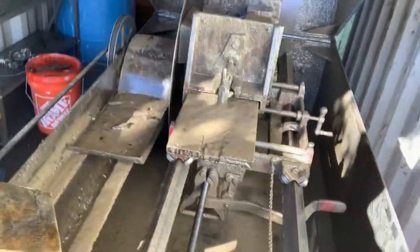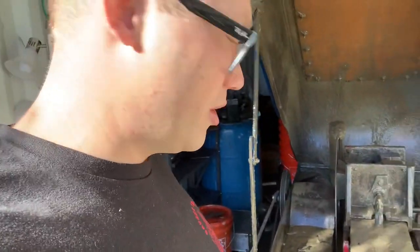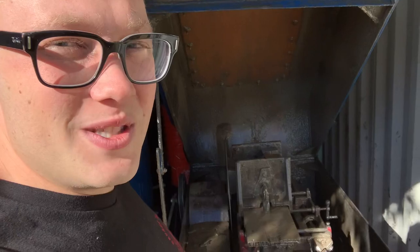And we use oil as the coolant. So the saw is sitting in mineral oil, and it's 70 weight, and that's key for the life of the diamond blade as well as safety and health. Now, you don't want to breathe the vapor that the saw makes at all. You don't want any of that in your body, even if it's a non-toxic oil. For example, diesel is an option some people use, and it's fuel. So if you're not careful, you'll burn your whole shop down.